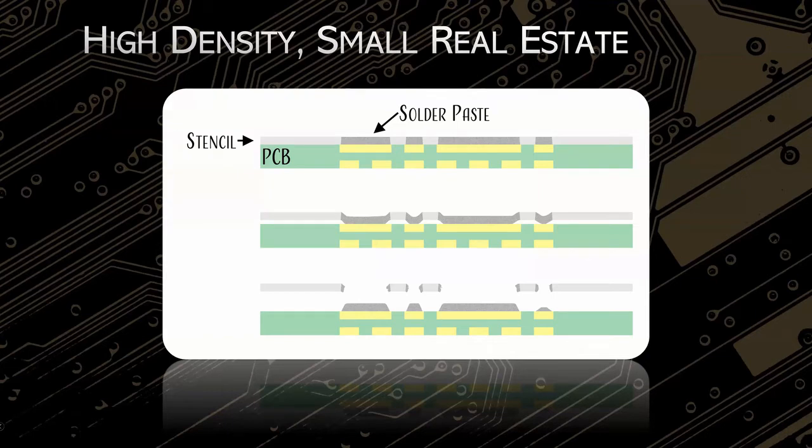There's a question from James: what is the average thickness of a stencil? We see a lot of four to six mils — that's usually what we use because we like a little more solder. If we see a design that has a lot of high density, we can definitely go down to a smaller mil size. Three mils is pretty common if you have micro BGAs or a lot of 0201s. One of the main reasons for this webinar is to share where we ended up with the technology we use today, which eliminates the need for guessing on stencil thickness — with mixed technology you'd want a three mil on one part of the board and a six mil somewhere else.